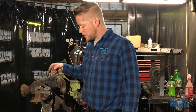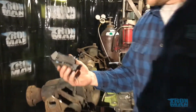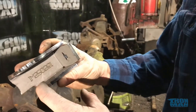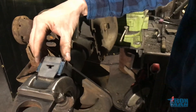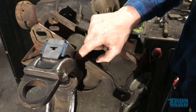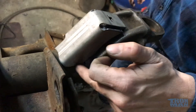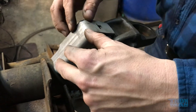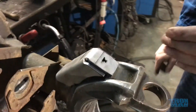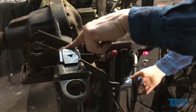I went ahead and flipped the axle over. I'm going to let this guy cool off a little bit — the heat's starting to work its way through. I've got the bottom cleaned up. This is our lower C gusset, and you'll see that I went ahead and ground that a little bit so it fits in here just so. See how we'll have a nice weld here, a nice pretty weld along here and up in here. You can see all in here is going to be a real nice weld area. It's nice and straight on — we're square, everything fits.